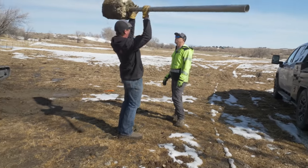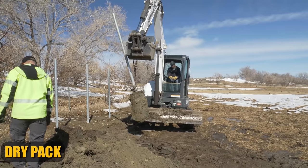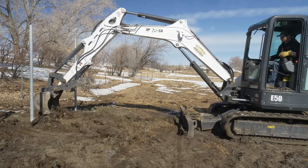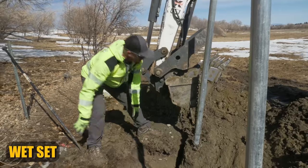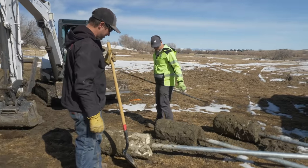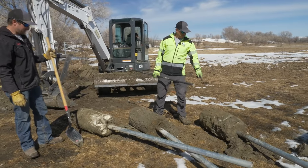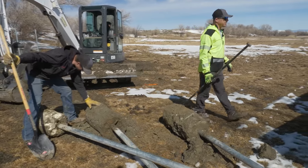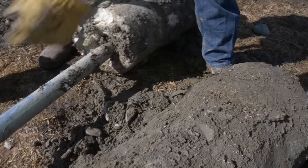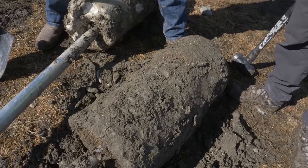Press it hard. That was some hard ground — yeah, it's frozen. So foam, dry pack, and wet set. Is there going to be any difference? I did notice when we did the dry pack that it seemed like all the Portland was going up to the surface. The way we're going to know is to break it open.